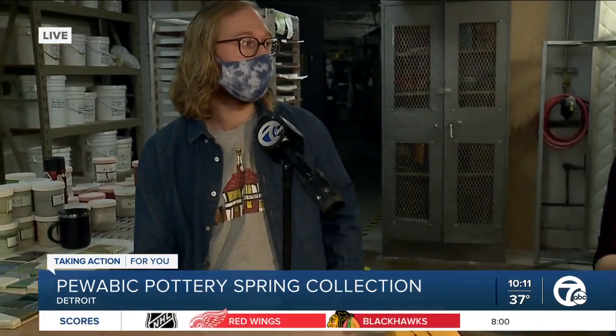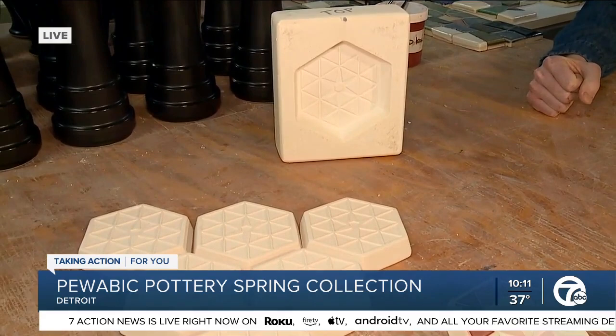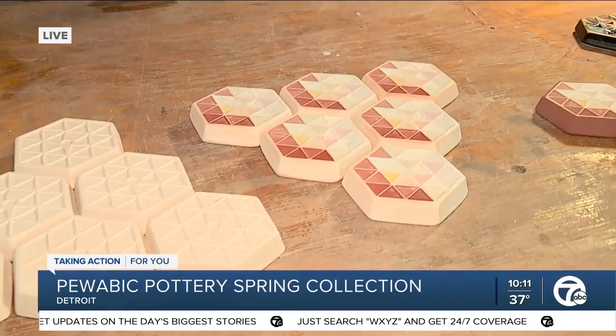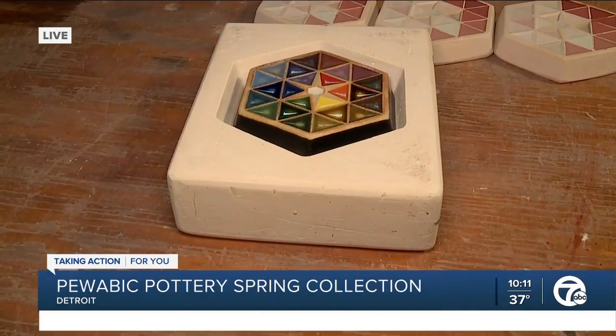Our tiles are first pressed into a plaster mold — which we have here. Oh, this is the mold? Yes, this is our mold. And it shrinks down quite a bit in the firing. This process takes two firings: first is the bisque firing, which is right here, and then once we have glazed, scraped, and cleaned everything, it goes into the second glaze firing, which is much hotter, and then it shrinks one more time. So this is the original mold size when it's first made, and because it shrinks during the firing, it comes down quite a bit to this final size.